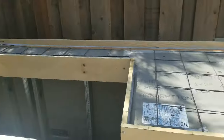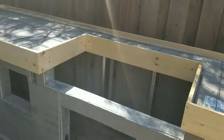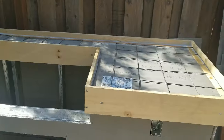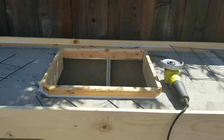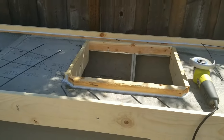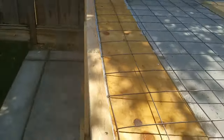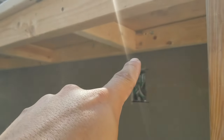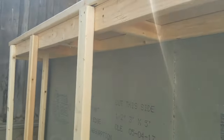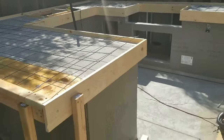A couple things to remember: the height from the counter to the floor. Most cabinets are about 36 inches high — I put mine just a tad bit higher, that's to my preference. I have my opening here for the sink already formed out. I just did a level across and leveled everything out, went around and marked everything to make sure it's all level. This is my overhang here. I went ahead and framed up a box frame all the way across and screwed into the cabinets to hold it — these are just supports to keep it at the same height.